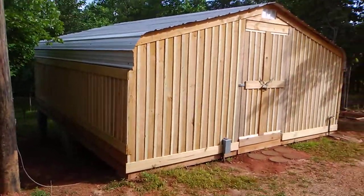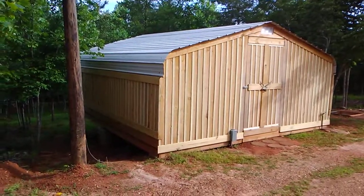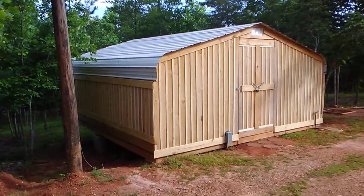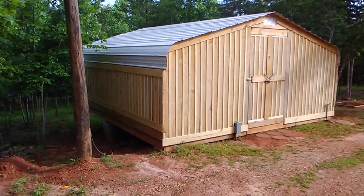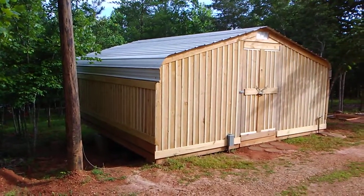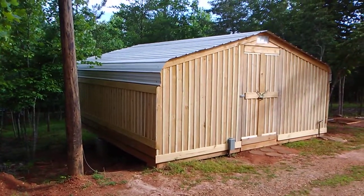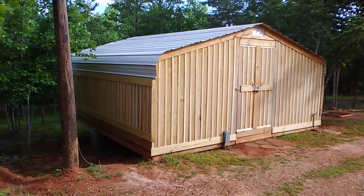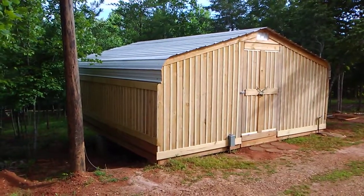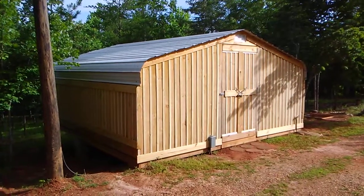For those who have never seen our video of our shop, maybe back up again — you'll probably recognize it as one of these 18 by 20 carports. I built a wooden deck with tongue and groove OSB, then assembled the carport on it. Then I closed it in with OSB, wrapped it in roofing felt — or tar paper as some people call it — and then put the siding over the roofing felt.